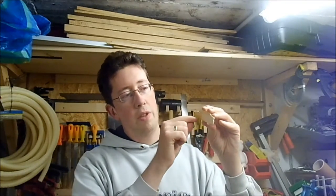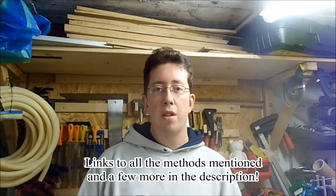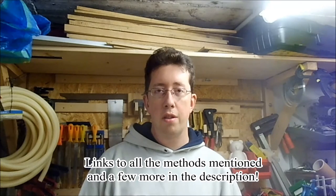The overhead projector sheet dries rather quickly compared to adhesive backing paper, but it allows you to see what you are transferring and gives you better ways to align it. That was my main beef with the adhesive paper — aside from the spotty looks — that I would have a hard time aligning the name evenly and centered. The next method I checked out was the heat transfer of toner by Jay Bates, using a laser printer.